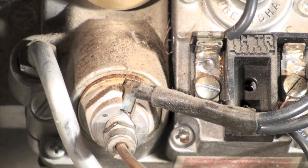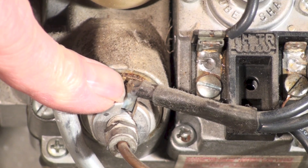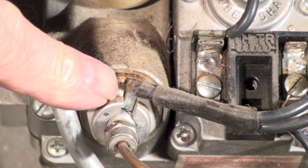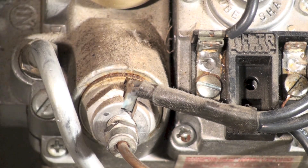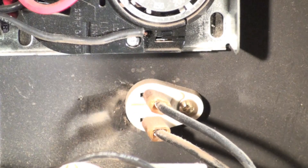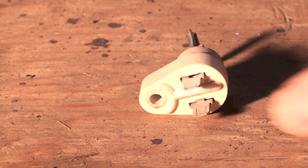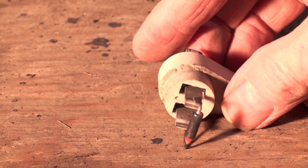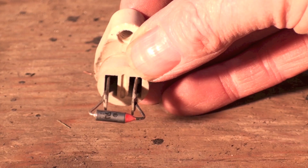What I'm wanting to show you here is these two little wires coming right down to the base of the thermocouple. There's a little button stuck in there between the thermocouple and the solenoid valve — the thermocouple solenoid inside the gas valve. The two wires go to this part here. I'm going to pull this part off and take it up to the bench. This is a high-temperature fuse — it doesn't blow with high amperage draw, it blows with high temperature.